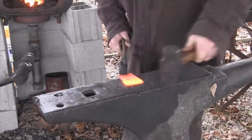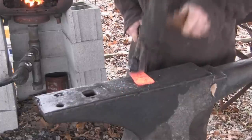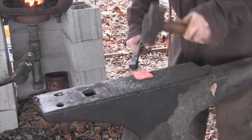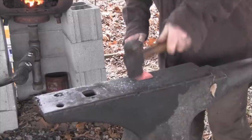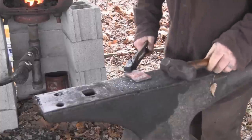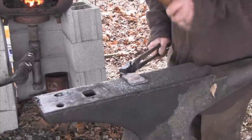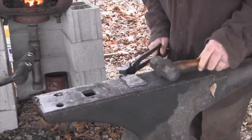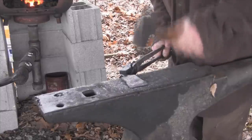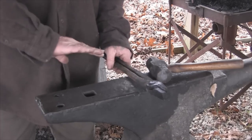This is going to be pretty much a chisel grind, so I'm trying to keep it pretty flat and keep this edge down here, because I'm going to grind it off when I anneal it anyway and sharpen it. Once it cools down I'll sharpen it. Right now I'm just trying to flatten it out, bell-shape it a little bit, get it to the shape that I want. I'm going to leave this tang on here to attach it to the tool.